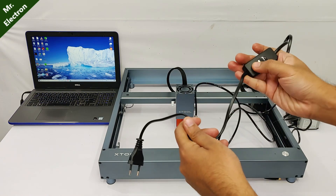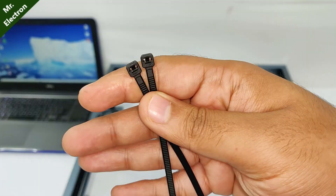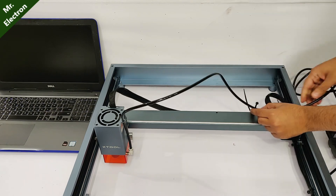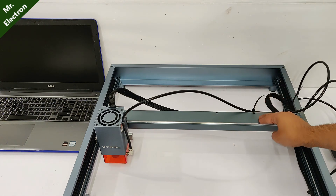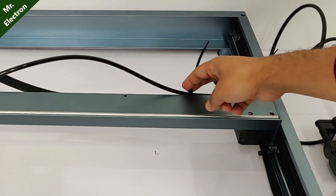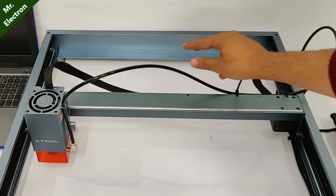Bring your laser to the complete left. Next, take two zip ties and install them like this. Next, install the pipe as shown. Two things to note: do not zip tie the belts beneath this piece, and don't zip tie it too tight because it is going to compress the pipe and reduce your airflow.